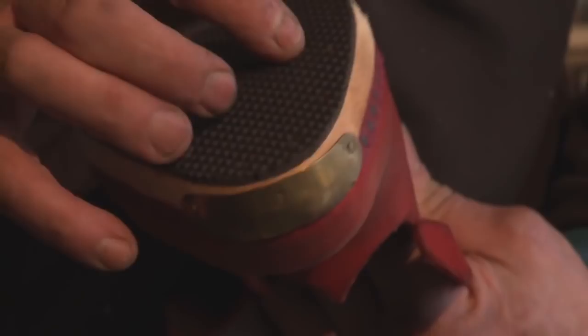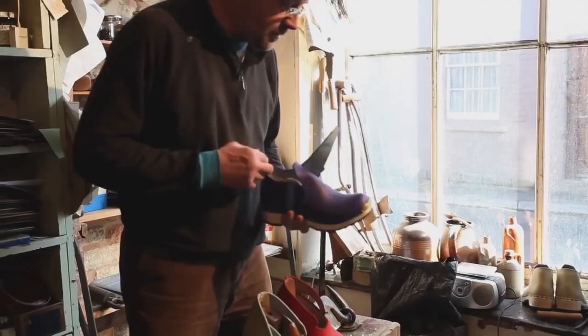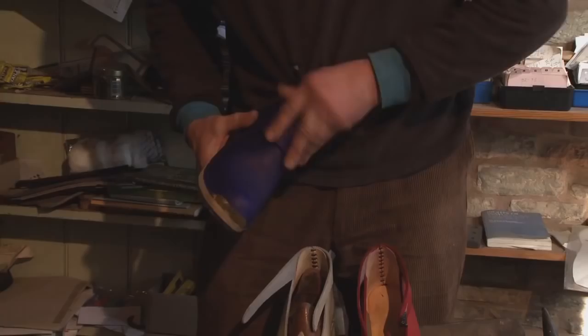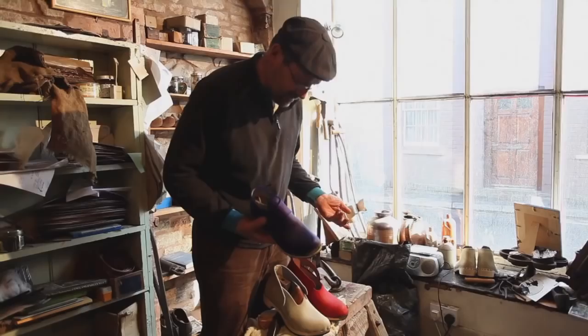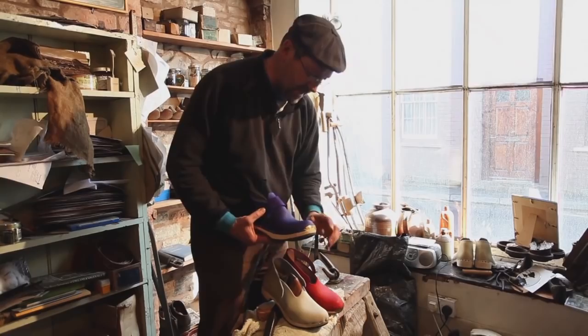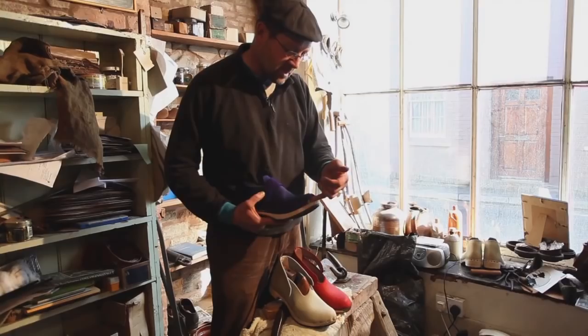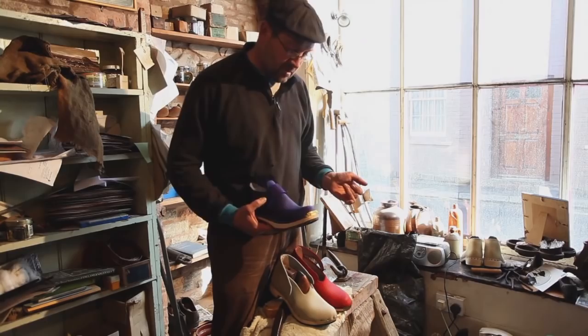This one has a three-nail outer toe tin in brass. This one is a different style — a more rounded toe. It's going to have a buckle or a button to hold it down there. That's how it's going to fit — it's pretty much finished, it only needs the button to go on and me to take the last out. This has got a toe tin that just sits on the ledge, whereas this one goes around the outside. I tend to prefer these, but these are more delicate — they look more delicate but they protect the wood, whereas the inner just protects the leather and can be a point of weakness. You have to put very light nails in because you don't want to make the wood like toilet paper with so many holes it's going to break off. So I don't use these very often. As a result I've got enough traditional toe tins to see me out, whereas these ones I have to have made up now — I've run out of that style.